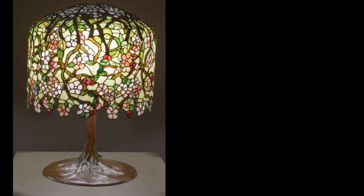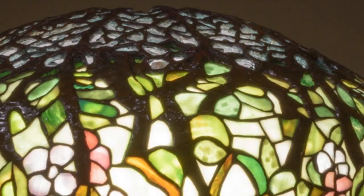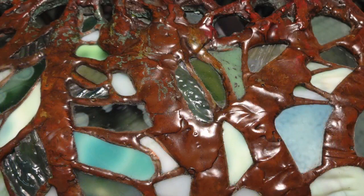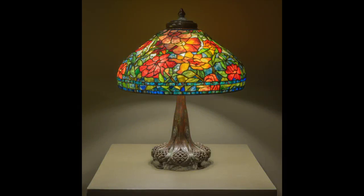The apple blossom announces itself as a forgery for slightly different reasons. The pattern of this lampshade has actually been altered. If you compare it to an authentic version, which we do have in the Neustadt collection, you can see that the number of background pieces, the configuration of the blossoms and the stems, are different — even sloppy. And speaking of sloppy, take a look at the solder on the branches at the top of this lampshade. It's not as noticeable when the light is on, but when you turn the light off and rake light over the top branch work, you see just how sloppy the soldering is. It appears to have been haphazardly applied, or applied by someone who didn't know exactly what they were doing.